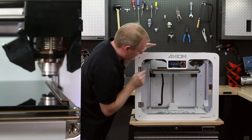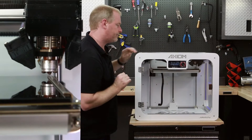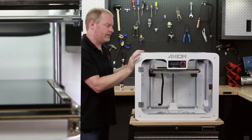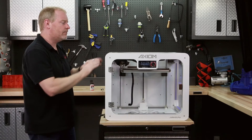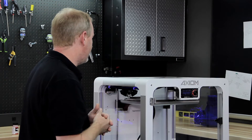Here's the second touch — that lead screw is at a slightly different position than it was over here, because the bed is never perfectly level. The neat thing with this particular auto leveling system is that even if this printer or the bed is crooked when it prints, the microcontroller will automatically adapt the 3D print to compensate.